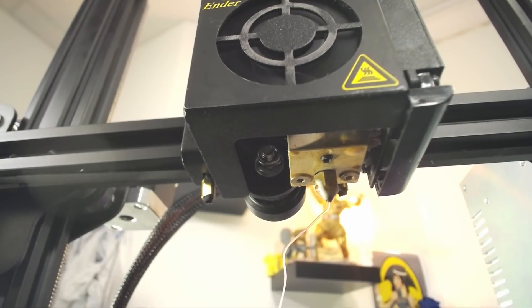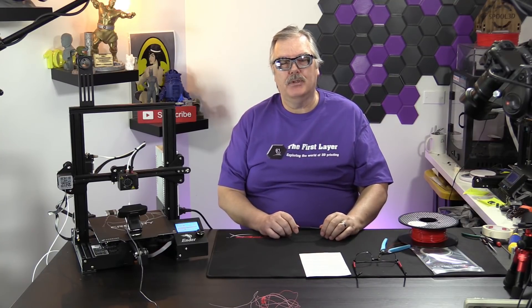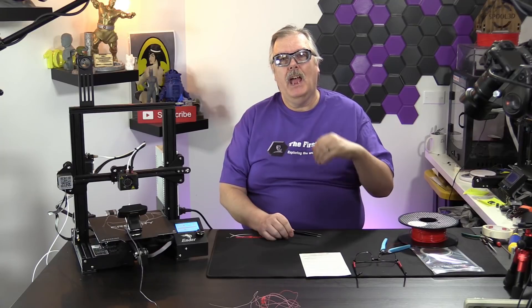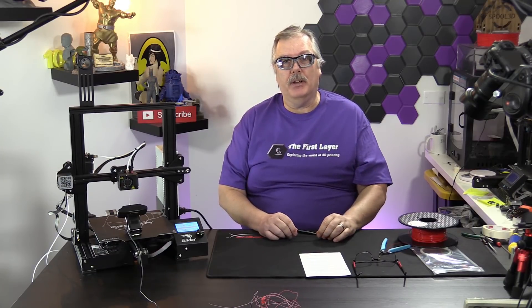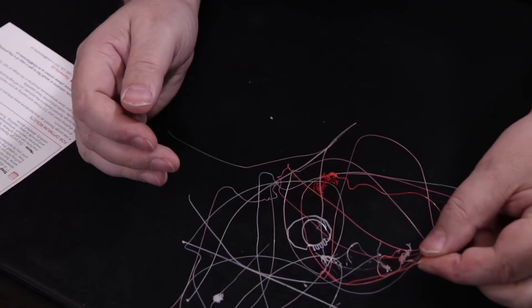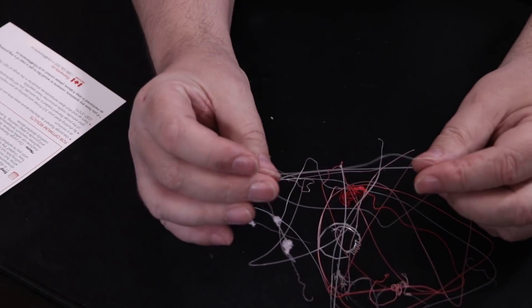You can see it's flowing a lot thinner now — it's way thinner than it was before. This material is really molten now. We've run the purge again up at our higher temperature, five or six degrees below our max for the Ender 3. Now we're going to bring that temperature back down to about 185. You can see where it started to extrude it was really, really red, but by the end we got nice clean filament. So this was the purge.